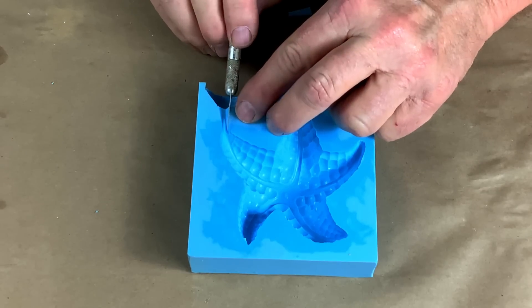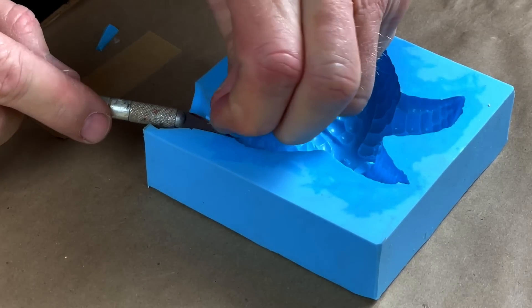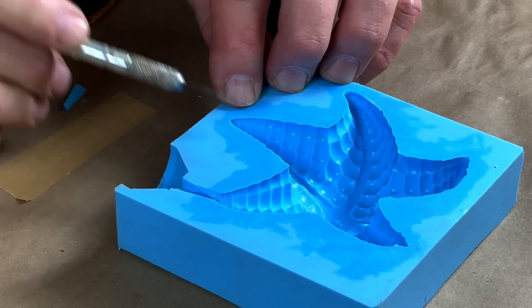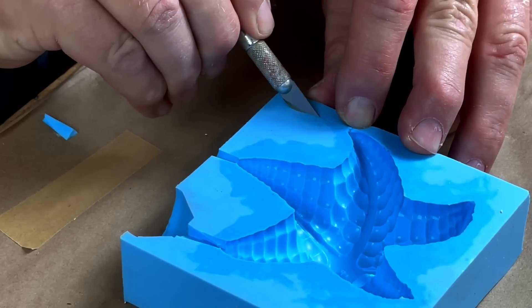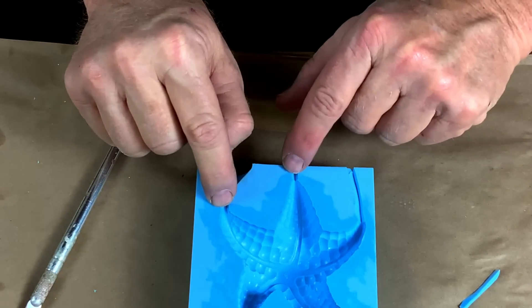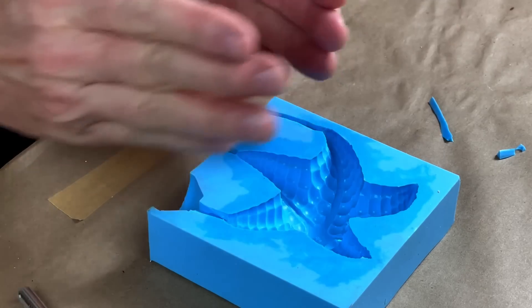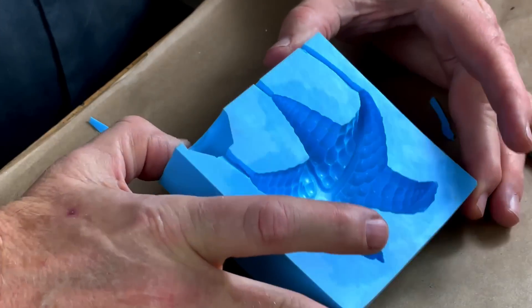Nice — it came out pretty clean. You might have noticed that when I set up this mold I didn't put in the sprue or the vents, because for this mold I'm going to cut them into the rubber. This is not my favorite method of work and I only use it in emergencies, but a lot of people swear by it and it's a good technique to know. Use a very sharp razor blade and simply cut grooves into the rubber. My contention is you're never going to get as neat a connection with a cut as you will with wax and carefully made sprues and vents — but as you will see, this does work.